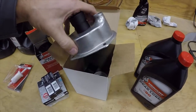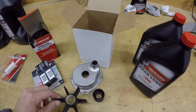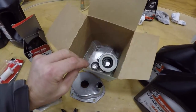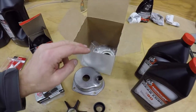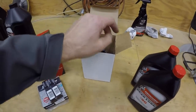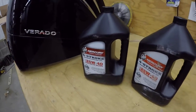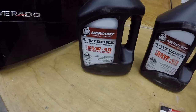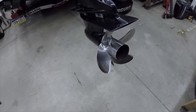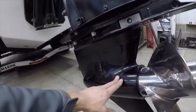I did purchase a water pump kit. I wasn't sure what I was going to run into — I've never done the water pump before. The big thing is the impeller, but I didn't want to get into it and find out the housing was worn or that I was missing a gasket. So I bought the entire kit — a little pricey, but I figured when I'm in there, I want to get it done. I've got my gear lube oil for the lower unit and I'm running 25W40 synthetic blend four-stroke oil from Mercury. We're going to pull the prop, pull the oil out of the lower unit, and then remove the lower unit to access the water pump.